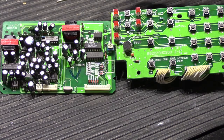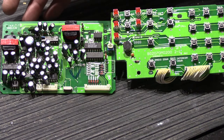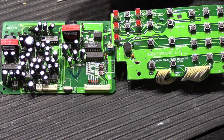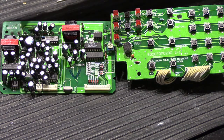Systems like the IM-5006 and IM-5000 are selective call systems, so they incorporate a lot of interesting design you don't see in other models. You can think of it as every station being a master station. On conventional systems like the 4406, the master station is 90% of the system — the remote speakers are just passive stations that can't do much on their own. On a 5006 or IM-5000, the remote stations are in many respects equal to the master station.